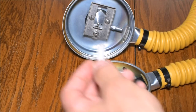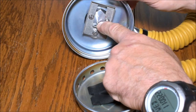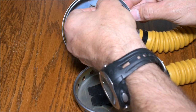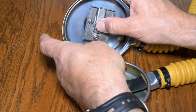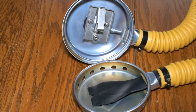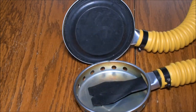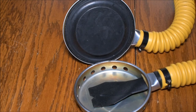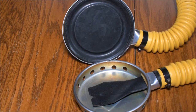So I'm going to show you the basic operation. There are levers here which will push on this pin, which is what activates the air flow. The diaphragm goes in here. I'm going to inhale — you'll see this collapse — and again you can imagine the air coming in this hose and going out the other. You'll see the exhaust valve, of course. And that's the way that works.